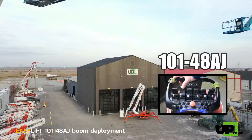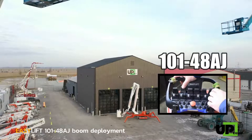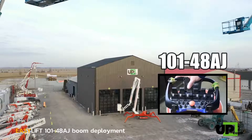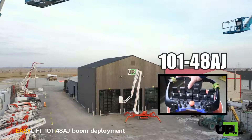The first step to deploy is to have the lower boom rise all the way up. Meanwhile, rise the upper boom slightly off the boom rest, about two feet. This is required for the next step.